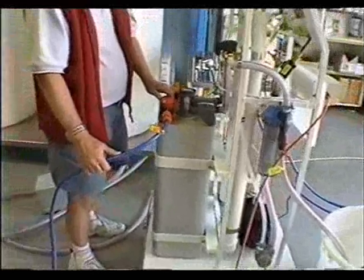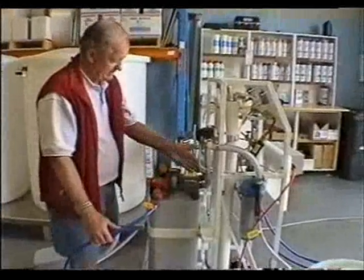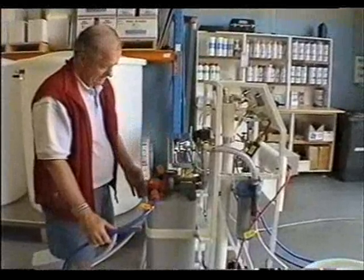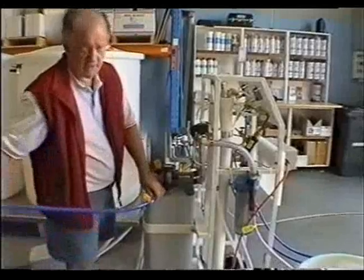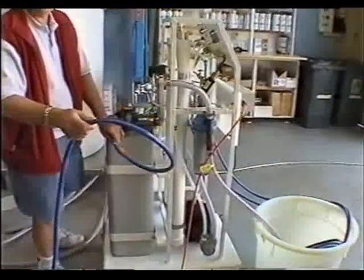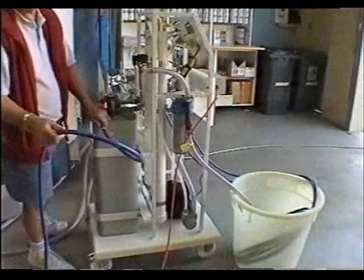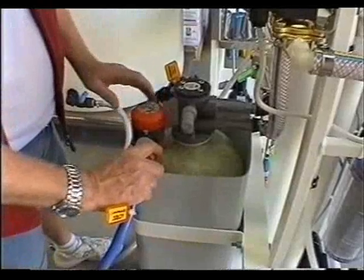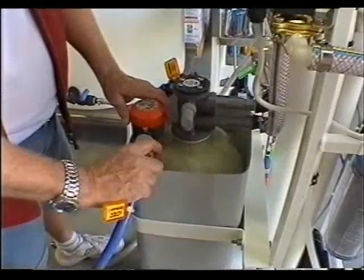All you have to do now is to leave it run and the water will flow through the incoming supply, through the carbon filter, past the timer switch and out to waste through the blue drain hose. Notice all waste hoses are blue for the convenience of the operators. After 30 minutes, the timer will stop and cut out and the drain will stop.